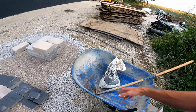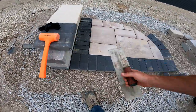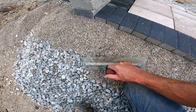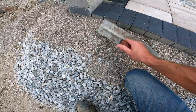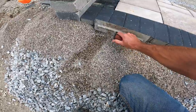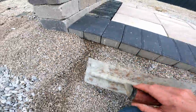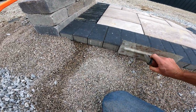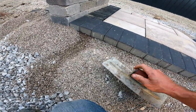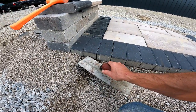We're going to do things as simple as mixing up some concrete, keeping it kind of stiff. Then we're going to come through on our bedding material here. We'll take our finish trowel and pull this back some — being careful not to undermine the pavers and respect the angle of repose — but we want to get in there so ideally this concrete edge restraint sits on our actual base.